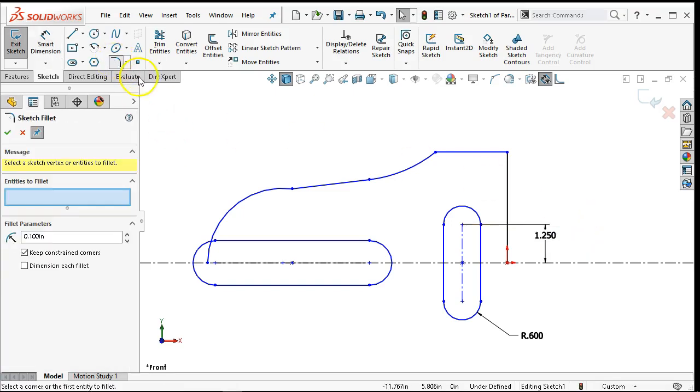If we go ahead with our fillet in this case, since there's two fillets, I don't know where that comfortable zone is where I stop doing sketch fillets. In this case where they're tied together, it probably is, but somewhere after I get over maybe 3, 4, 5, 6 fillets inside of a sketch, I'm just going to leave vertexes and go right to the fillet feature. So entity to fillet, again, if you for some reason do not have a vertex, maybe these lines stop short and we just didn't care to connect them, I can always go back to the previous and select the two objects. So objects that don't exactly connect, I can still pick those geometries and it will create the fillet.